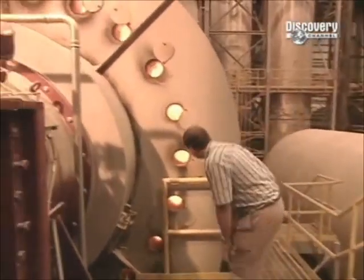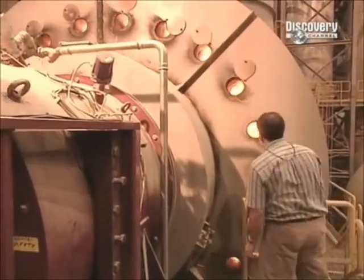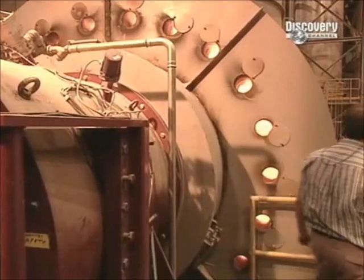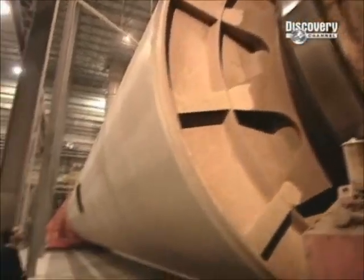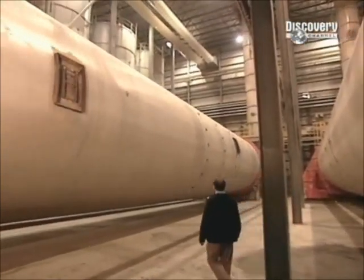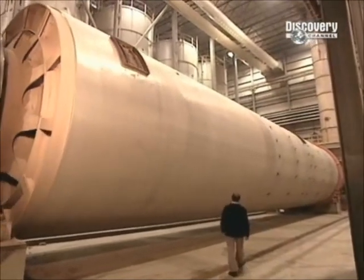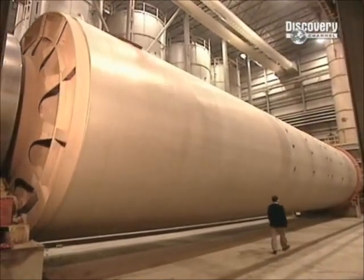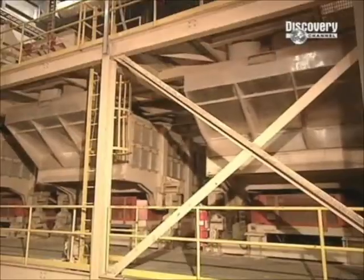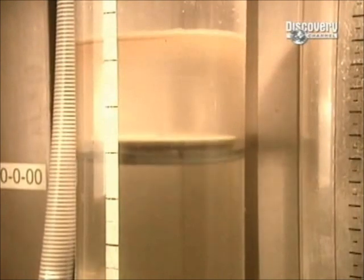To take out any excess moisture, the particles are put into giant dryers for 25 minutes, whose combustion chambers are fueled by leftover dust from the chopping mill. From here, they'll send the dried out particles to a screening machine, which will separate them by size. Pieces too big are fed through the mill again. Larger particles go into the rougher core layer of the chipboard. Smaller pieces into the smoother surface layer.